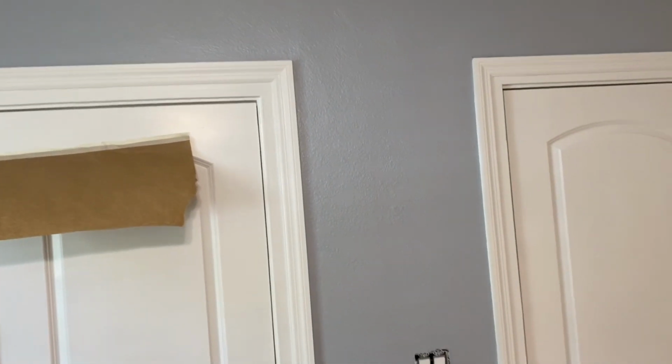Look at the pattern and rewind the video and see what I'm talking about. It's very important to get a layout that has no lap marks. You have no lap marks here. You can't see where the roller made its columns of paint. And now it's all drying at the same time because it's all wet together. And that's the key to painting successfully one wall. And this is my one wall at a time method. Now we do the same to this wall.